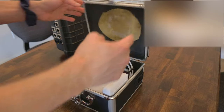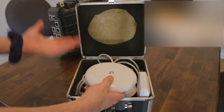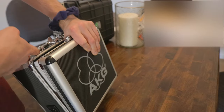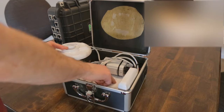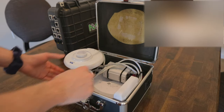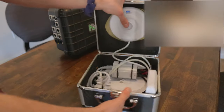What I've devised is essentially a GigaBeam, an access point, and a switch — all in the old shell of network in a box. The idea is that I could VHB tape the GigaBeam up here for receiving, close it up aimed out the window facing my apartment. Inside we have a NanoHD access point, a USW Flex, and two PoE injectors — one 802.3af powering the switch and access point, and one 24-volt passive powering the GigaBeam. Just made out of scraps I had laying around, but I think it's pretty good.